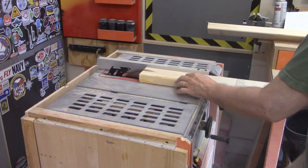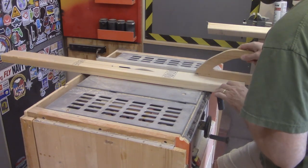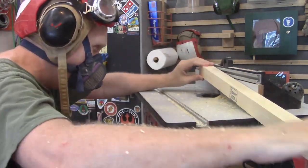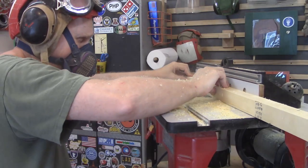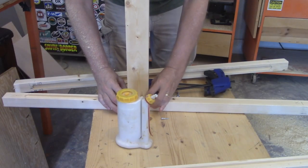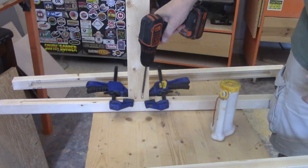More 2x4s are cut into 1.5x1.5x42 inch strips that will form the corners of the parcel box. The corner pieces are going to hold shiplap boards, so channels are routed in them to hold those boards. This job generated a very large amount of sawdust. With all the structural pieces complete, it was time to begin construction. Gluing and screwing things together will make them strong.